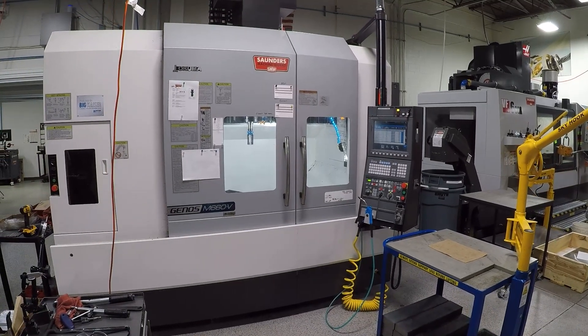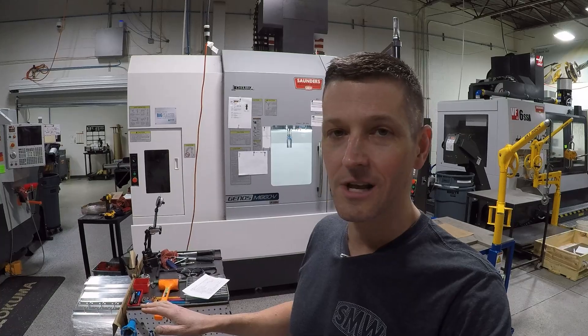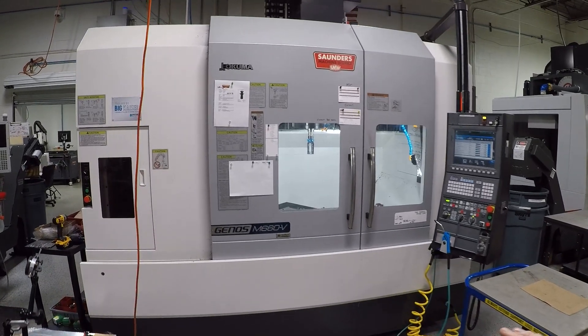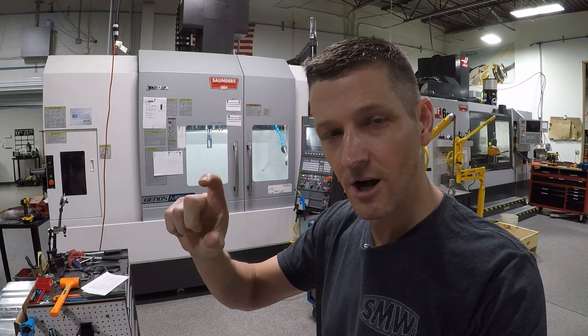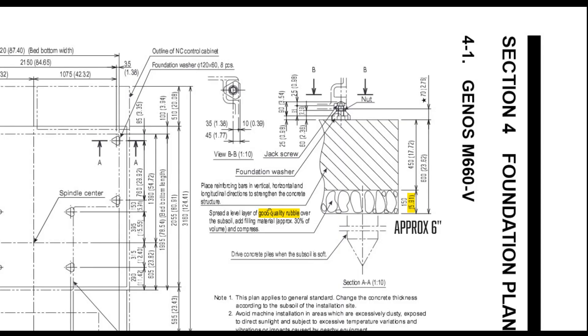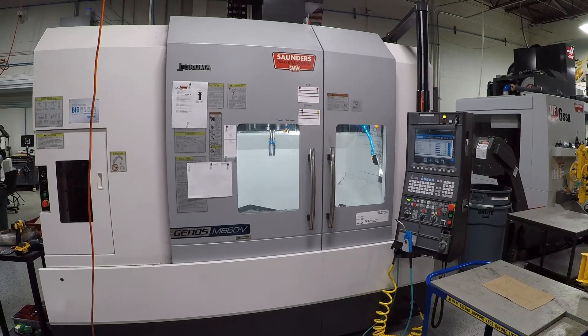The Okuma foundation spec was something we were not going to meet — and I don't think that's uncommon. I reached out to five Genos 560 owners and none were even close to the builder spec. We've been in this shop six years and know the floor — it's been stable, hasn't shifted or cracked. We only have five inches of concrete, but our plan was to install the machine, level it, and see how it runs. Worst case, we'd pour a proper pad in a different area of the floor, let it cure, and move the machine over. So far it's been stable. My understanding is it's not just concrete thickness but also the PSI, rebar, and what's underneath — and knock on wood, we have solid soil below our concrete without air pockets or hollow spots that would affect accuracy, tram, or level stability.